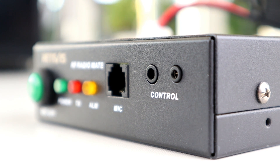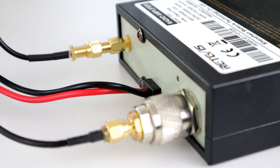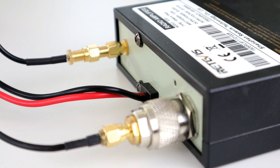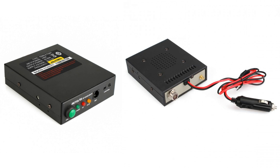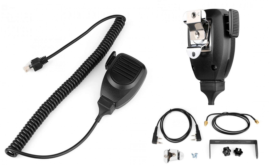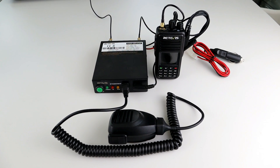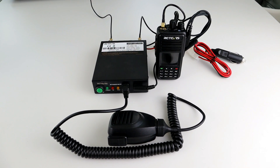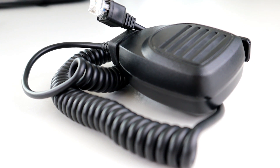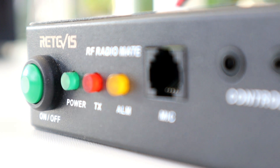It has a high output power of up to 30 watts, which compared to five, six, eight or ten watt handhelds definitely packs a punch. The size is quite small — it's not a big unit at all, making it a perfect companion for field operations without any real added weight. Safety features include voltage spike suppression, over-temperature protection, RF sensing, automatic power control, and harmonic filters. It also has a large built-in speaker, a microphone socket, and a status indicator showing the working status of the device.